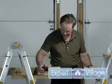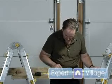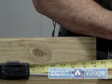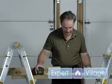On the scale, as we had on the other one, we have a mark at the 16-inch point, but this also has a highlight at each foot — the two-foot and the one-foot measure. So that's easy when you're measuring for different framing.